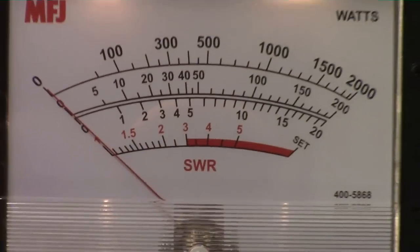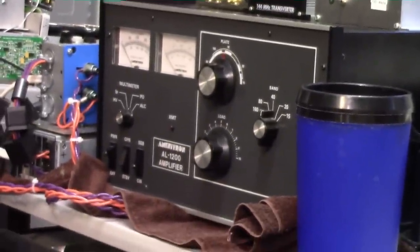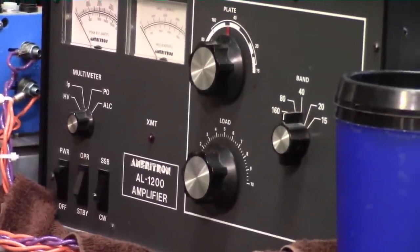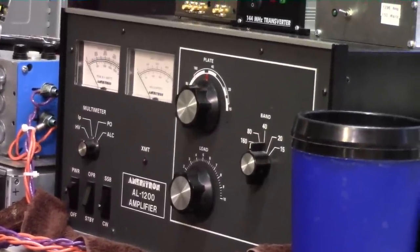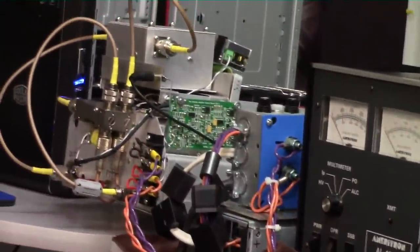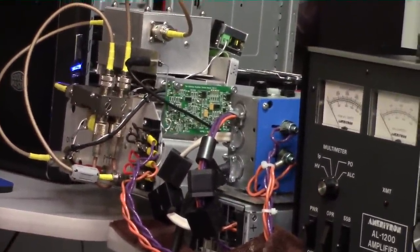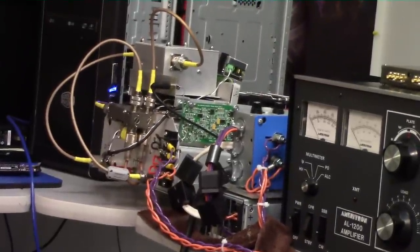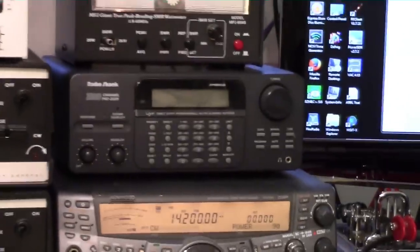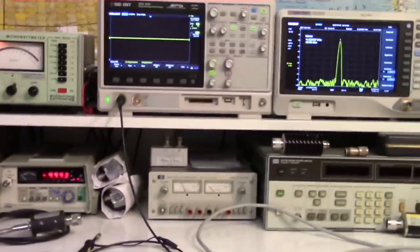This particular one is the 868B and I've got a couple of them. I'll typically use one on HF with an Ameritron AL-1200, which will easily put out 1500 watts, so that meter works well for it. Hidden back there is a Harris 6-meter solid-state PA — a channel 2 power amplifier — and I'll have another meter hooked up to it to monitor the 6-meter power. So we'll be grabbing RF power and measuring it using some actual power meters, but the interest to me was measuring it in different ways.